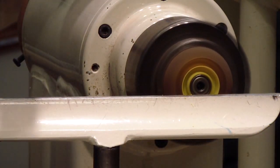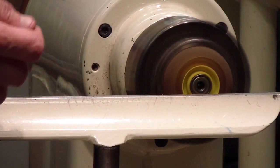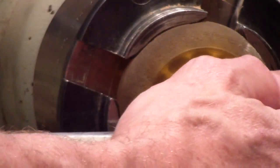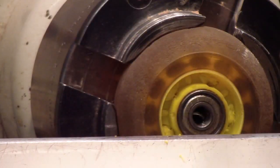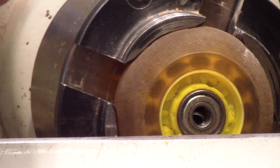You need to stop every once in a while — if you can see a whole cluster of shavings, you need to stop and clean it out. Because there are recesses in here, and when that comes around and catches in that recess, there will be a big cluster of it and you're going to pull your tool down. It's not too important now, but when it's just about the time you break through the end, they've also scooped it out the back side too, so it may have a real mess.